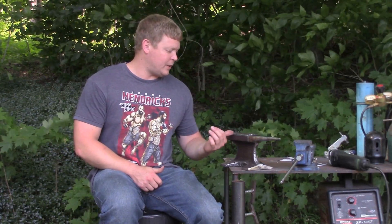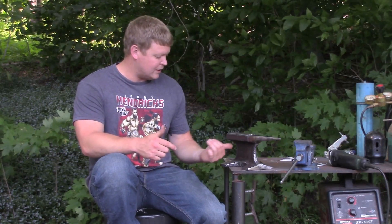I just finished up our anvil project — it came out pretty good. We had roughly six hours into it. Things the project included: oxy-fuel cutting, grinding using three different discs — hard disc, wire wheel, and a flap disc — MIG welding on the edges, and stick welding padding on the top. It was a nice little project with a lot of different processes involved. Take this thing, throw it in your garage, and you'll be surprised at how much you use it. Thanks for watching and subscribing to TVWeld.